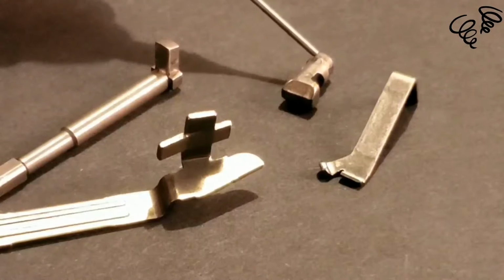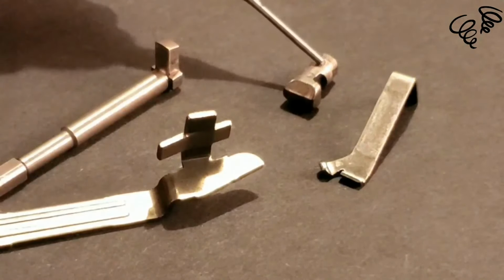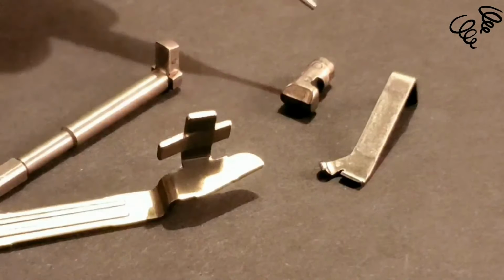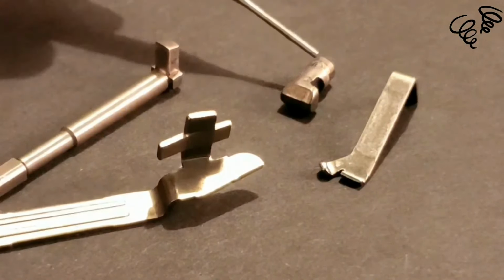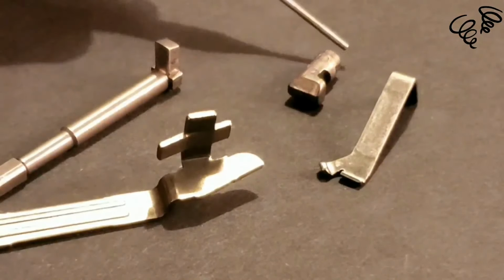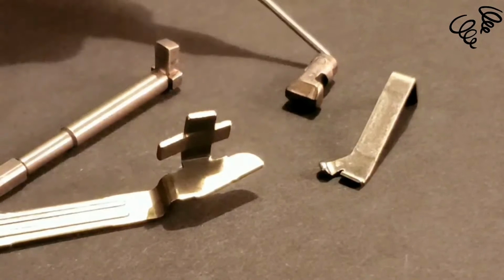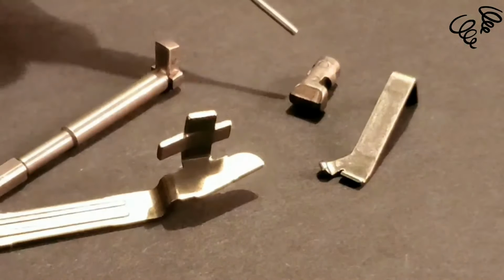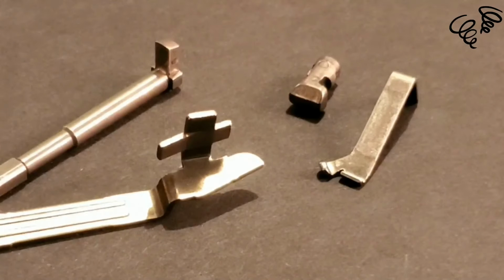I like to do the entire safety plunger because where it sits in the firearm is a little slot, a hole. It goes up and down. So getting this polish is going to allow it to depress and engage when it's making contact and the trigger is working. It's going to flow up and down almost like a piston movement through that port.